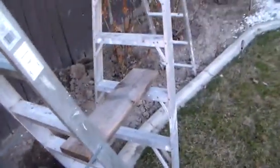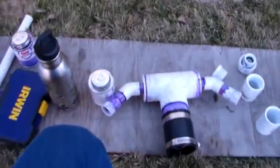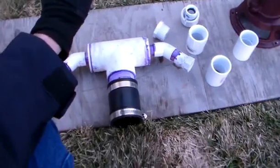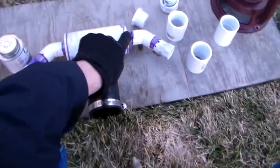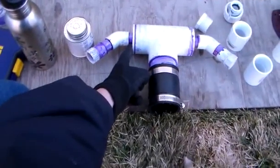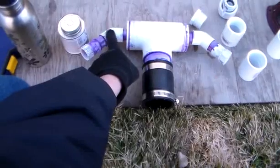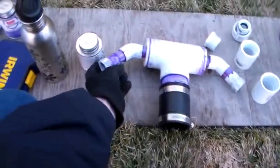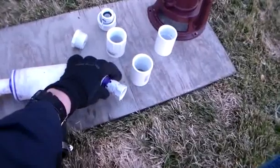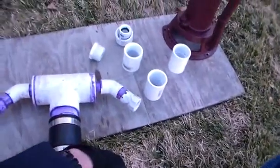This is my makeshift scaffolding — I'm going to need it. Let's come over here and talk about the wellhead a little bit. This is the wellhead — I made this. This is a two-inch tee. On the sides here and here are two-inch to three-quarters inch reducers. These elbows are three-quarter inch fittings, and these are for your garden hoses. You're going to put garden hoses in there.